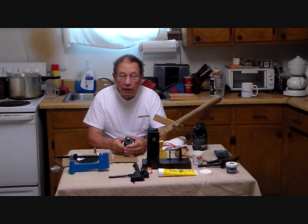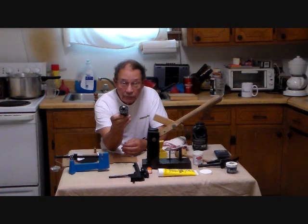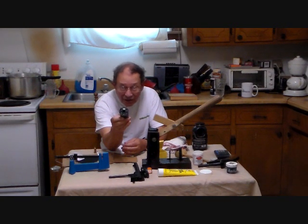What we have achieved with our loading stand is a very nice uniform seating of the balls below the chamber mouths. This tells us a couple of things: these Uberti chambers are very nearly the same dimensions — something not necessarily true with replica percussion revolvers. And it also tells us that this is about the right load. This does fill the chambers just about to the mouth.